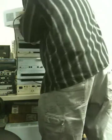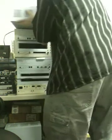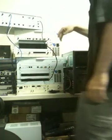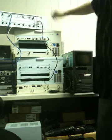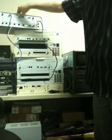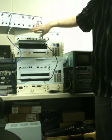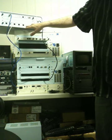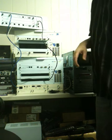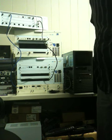The power is around the back. Then give it 5 or 10 minutes to come all the way back up. You should see this light blinking. Once the T1 card comes up, you should see six solid green lights. On the analog line card, once it has finished booting up — when they're all blinking together, that means it's still booting up. Once they start going one by one, blinking intermittently, that means it's up. And basically, that's all there is to it.